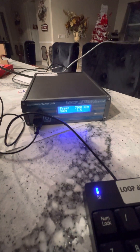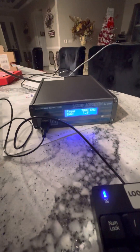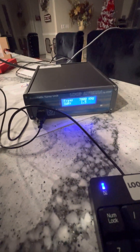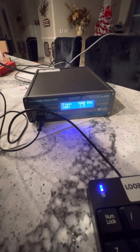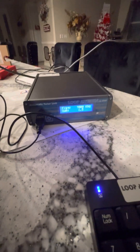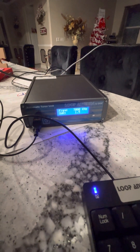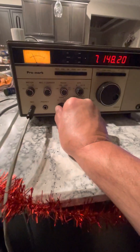It's pretty easy to set up — in, out, power, power to the antenna, and the USB port on the front. You can also get a cable from DX Engineering to have the radio command the controller, so when you do a band change this thing is already winding up the loop for the next band or frequency — that'll speed things up even more.